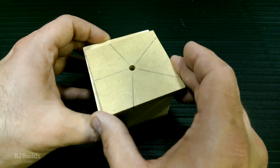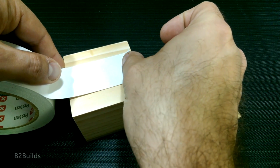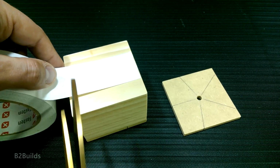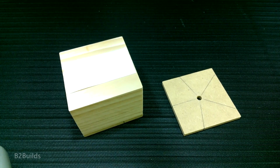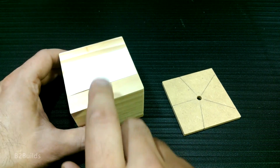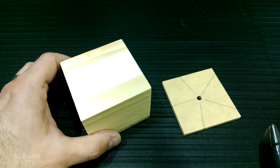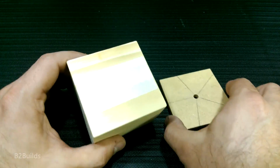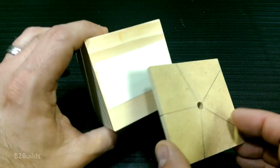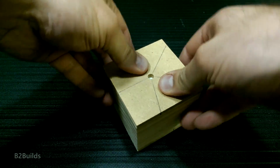And then to attach those plates, we just take this 1.5 wide, double stick tape, pretty strong stuff that I got here. Again, I'll include links to this in the description. And we cut that to the full 3-inch length of the block. Peel off the backing. Press that plate onto the block. And our dodecahedron blank is ready to go.